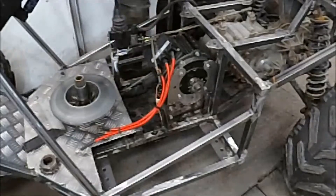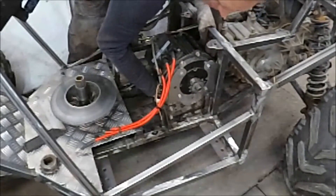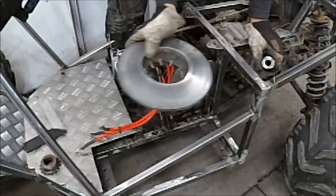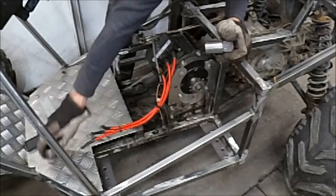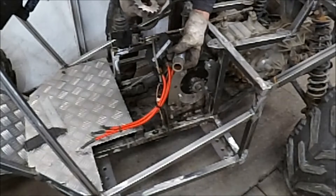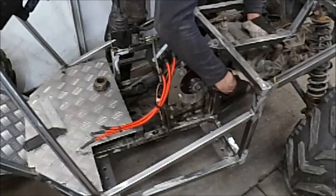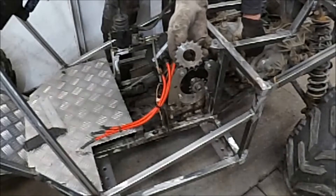Now the motor is in position and it's also set up so I can tension the chain. I've also done some cutting here on the clutch — the second variator — and I've got this piece left and I will machine this spline part down to 30mm so my sprocket fits. I also have other sprockets if I'm going to change gearings. I'll put the sprocket here and change this one to the same size — this is size 428.